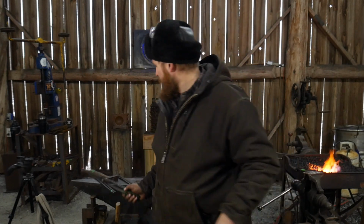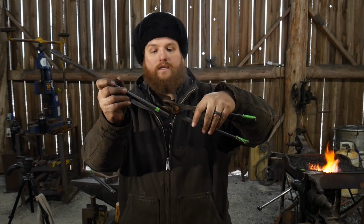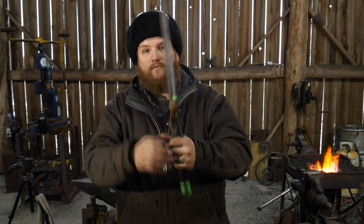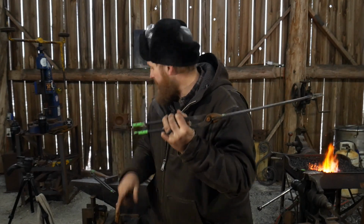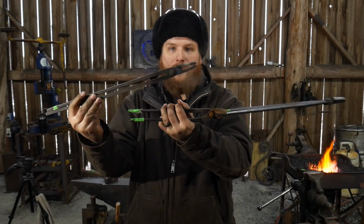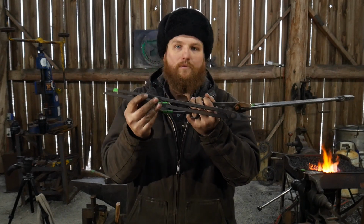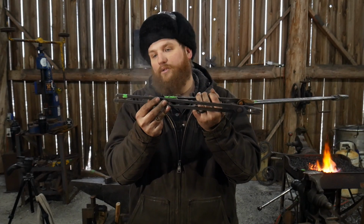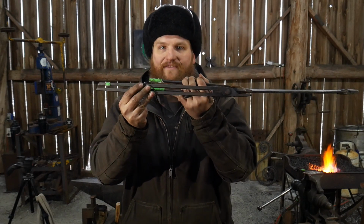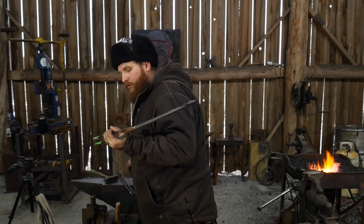The short pair of tongs has a drawback though. When you grip a piece like this, okay, look how little leverage you have versus a long pair of tongs. In the earlier example, these are almost 8 inches longer on the reins, a little less than that, about 7 inches longer. That gives you a lot more leverage.